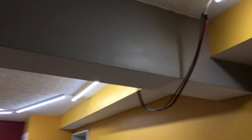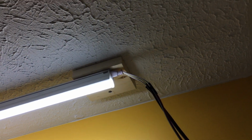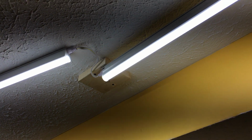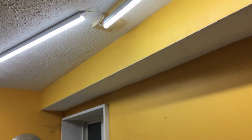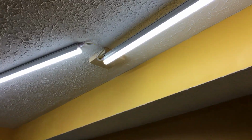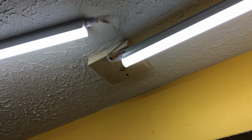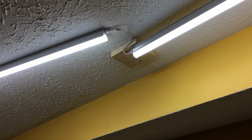What I've been doing for installation, I'll show you. Initially I was doing 1x4 girder sections, and these are about 4 inches long if you take a look under there. So not super big, just as cleats. But what I've decided to do instead, and I've shifted towards this, is just doing the one piece in the ceiling. So this is just again another 1x4 section cut to 4 inches, and I'm doing that every 4 feet, which is convenient because then these lights are 4 feet long as well. So that'll work out for the most part, and this is enough here that I'll be able to screw the board into the 1x4 right there. So that won't be hard, and it'll be plenty sturdy as well.